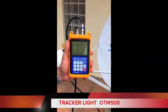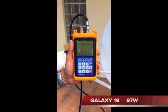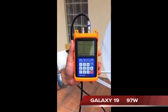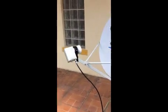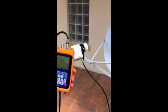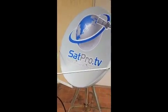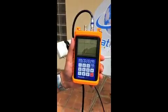Today we're going to be testing the Tracker Light satellite meter by Orbital Tracker on Galaxy 19, which is located at 97 West — a very popular FTA satellite. You can see we're using a pretty standard 30-inch dish, probably a little bigger than 30 inches, using a universal LNB. We're basically going to locate and lock on to the 97 West signal using the Tracker Light satellite meter.